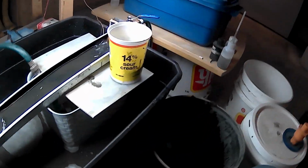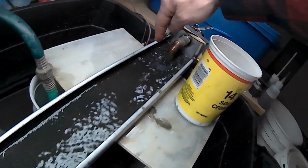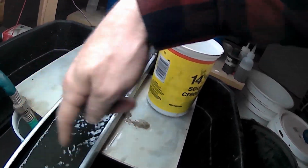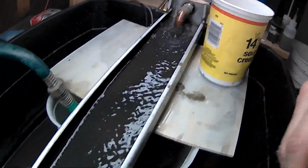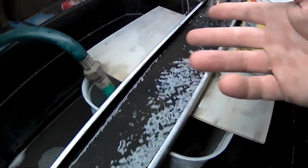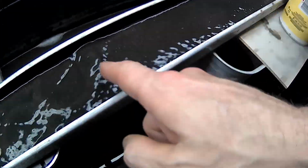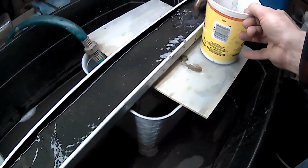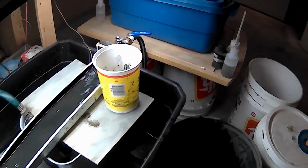Before I drop it, everything underneath of it has water, which dropping would just be bad. So I'm going to keep on rolling through here, pulling these magnets out, going back and forth with my snuffer bottle. I run it along one side, then I run it along the other side. The idea is that the heavies go back and forth in the bottom of the riffle and the sluice run, the lights flow off. Basically the same principle as gold panning. And you just end up with the heavies in the very bottom of the sluice run and hopefully all your gold. So it all stands up on edge, gold gets trapped in there, and then I scoop everything up and put it right in the old bin here. Whatever I see, I put in the snuffer, and whatever I don't see, it goes into the magnetite.